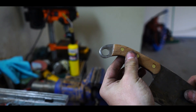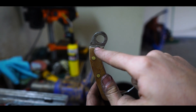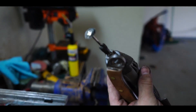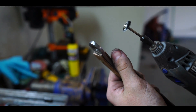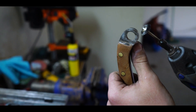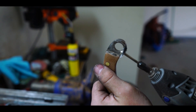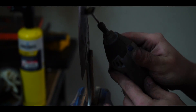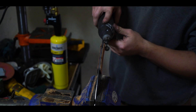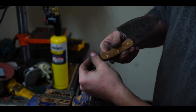I'm going to show you guys what I'm thinking about — you're mounting your handle to your blade. Look at all this buildup right here of extra resin. All you've got to do is get a little wire brush attachment for a Dremel and hit it in there — it won't destroy the wood or the metal, but it'll knock away all that extra resin, almost like a sanding wheel. So it's really easy and convenient. Look at that — good as new, no overflow.